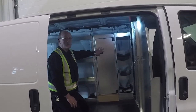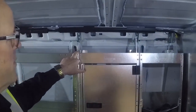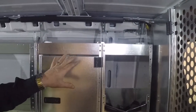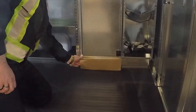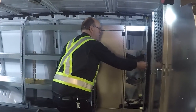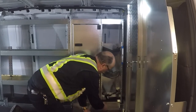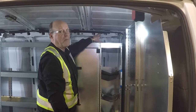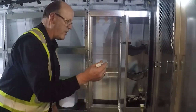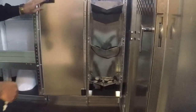Now that we've set our garment locker and our freon tank holder in place, you'll see that on the top we shared a common bracket between the shelving unit and the garment locker, and the garment locker and the freon tank holder. Once we've got this installed, we would then remove the bottom carton. I'm going to take my level and put it on the edge to make sure that we're sitting square. If we're not, we can pull it out or push it in. The top brackets dictate exactly where the top has to go, and the bottom would need to be adjusted. Then we use a white marker to mark locations for installing the nutserts.